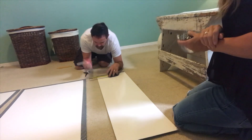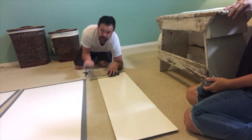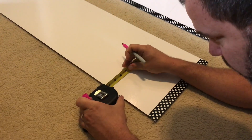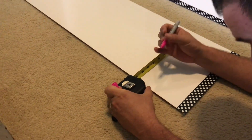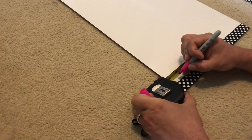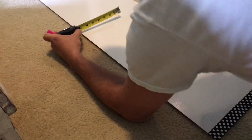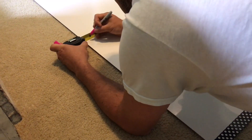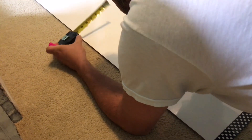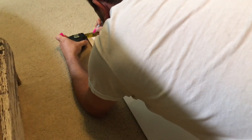We use the Sharpie because it actually sticks. What we found is we're going in one inch because the tape is about two inches thick. You just go down to one end, find an inch in, and give a little mark — doesn't have to be much. Then go about halfway down the board and do the same thing, just one inch in, a little dot. Then all the way down the same thing, one inch in.